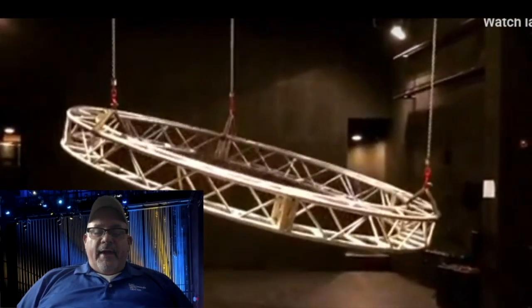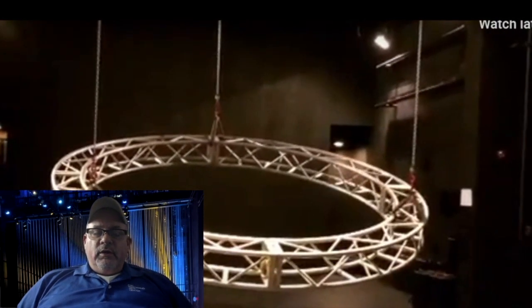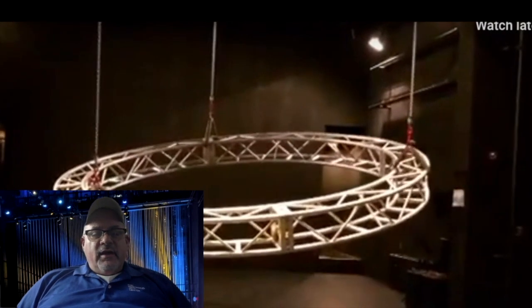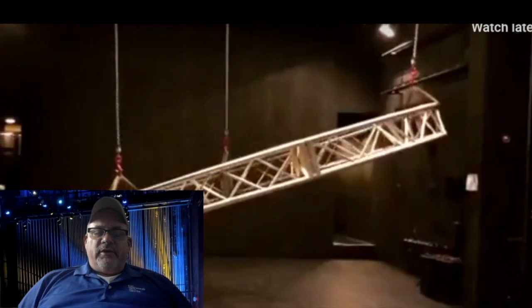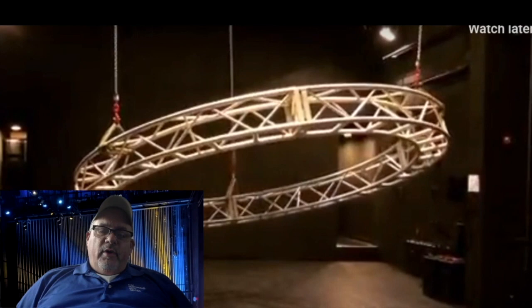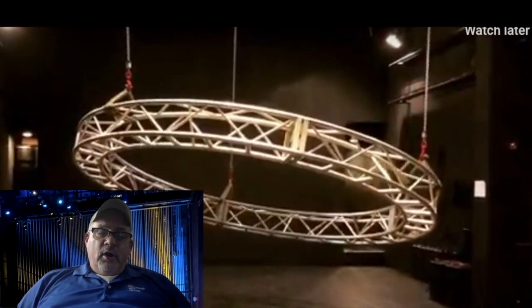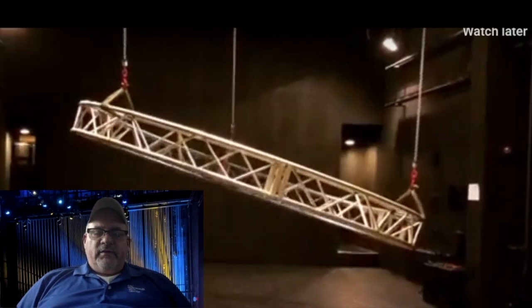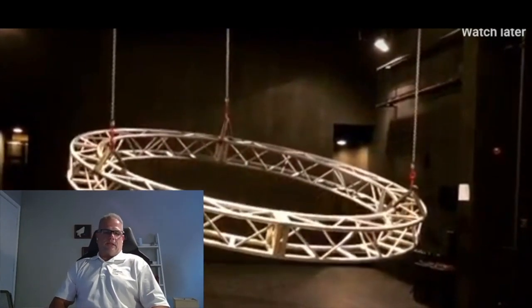At a rock and roll concert when you see a giant circle in the air, that's probably supported by multiple motors. On a circular truss you should have three motors, but it creates a force between them, so most of the time you won't see a circular truss move. If you wanted eight motors to move at the same time, you can control them from a pendant — an eight-way pendant that is plugged in — rather than needing eight different people.